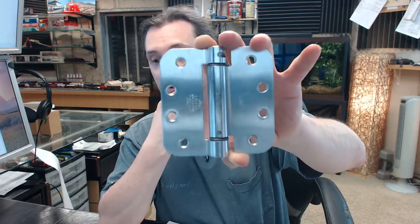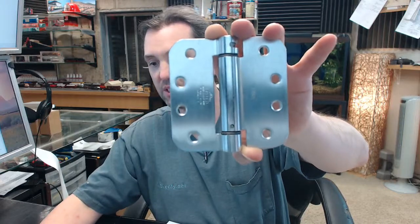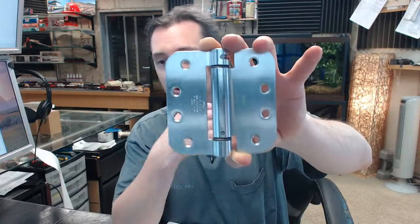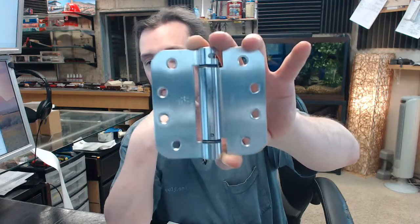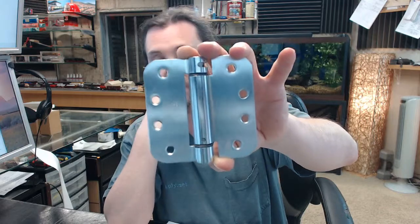It's non-handed, with self-lubricating bearings, easily adjustable spring tension, and ANSI template pattern screw holes. We'll go over more of that in a moment. The pivot point aligns with residential butt hinges. We'll talk about that in a moment. 5/8 radius corners, etc. Let's dissect the part number.